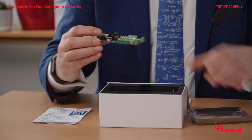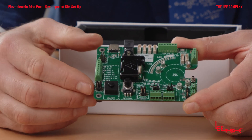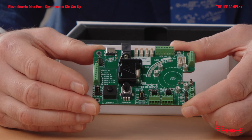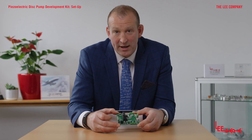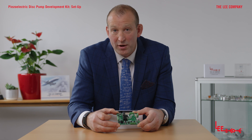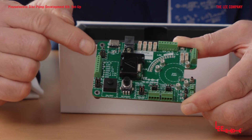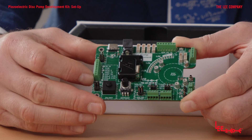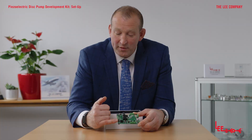For those of you familiar with our evaluation kit, you'll note it's a very similar format. First, we have the USB connector, which enables you to link directly to your laptop and run through the app. Note that you will need a minimum 500 milliamp supply through your USB connector — if you're using a powered USB hub that should be fine, otherwise please check. We also have program headers and a breakout connection so you can control through analog or UART, and connect up to things like an Arduino or Raspberry Pi.